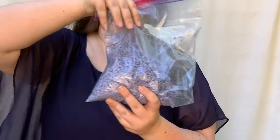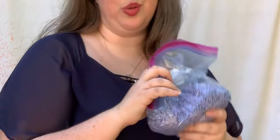You have failed attempts. I had one mold where the silicone kit had something wrong with it. We're not sure what. I've written the manufacturer, but I haven't heard back yet. Anyways, if you have a mold that you're not using anymore or a failed attempt, you can cut it up. I cut mine into chunks and then I used an old blender to chop it down into fine little pieces. Then you can pour this in your wet silicone, about half wet silicone to half chopped up pieces, and reuse it. That's great when silicone making kits are kind of expensive.